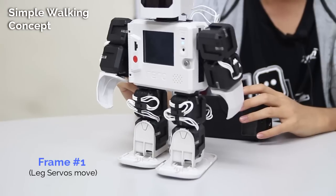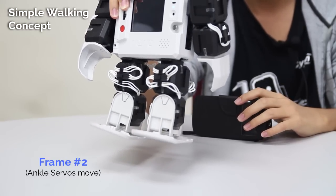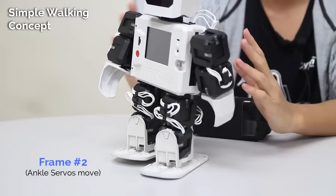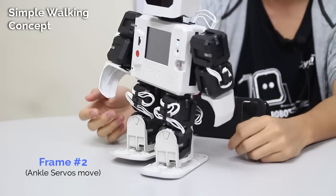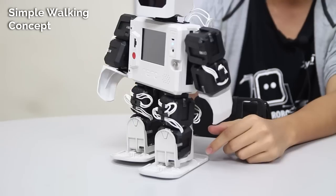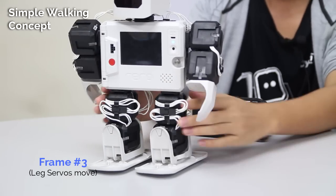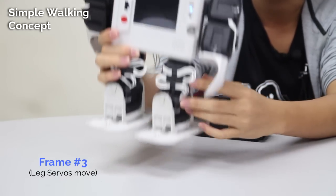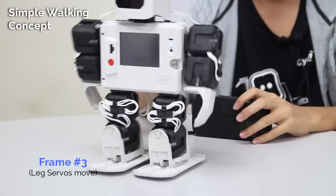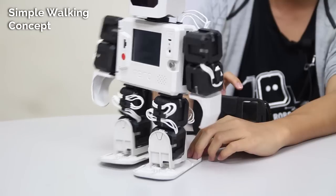The first frame is done like this. Now in the second frame you can see that the ankle servos are moving. It's actually only a very small movement, but this is already enough to shift the body weight. That's mainly what the ankle servo needs to do — shift the body weight from left to right, just balancing the robot. In the third frame, it's the leg servos' turn to move. Since the ankle servos have shifted to a position where most of the weight is concentrated on one leg, when the leg servo shifts, it puts more concentration on that leg and then pushes itself forward.